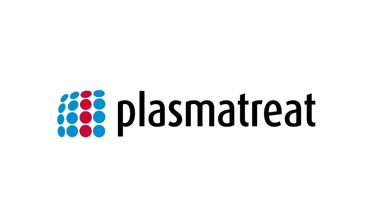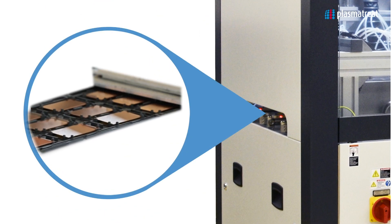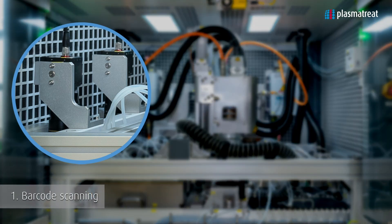In the past, using plasma to get rid of oxide has been there in chamber plasma for a long time. Basically now we have really brought something to the market where we can do it as an inline process. The tool basically has three stages. We have a heating stage — it's not necessary but it helps to move the process a little bit faster. Then we have a stationary plasma jet which in this particular case has a 135 millimeter treatment width, so we can put one head fixed and the parts will just go underneath.